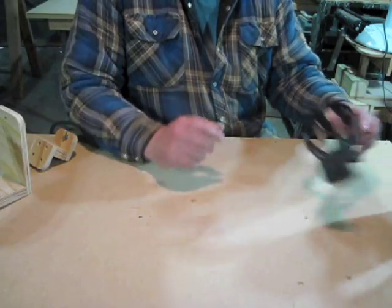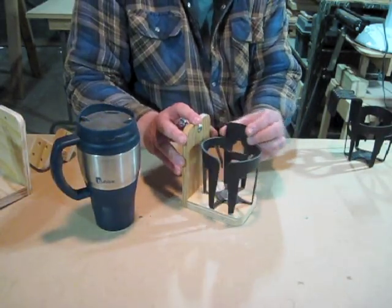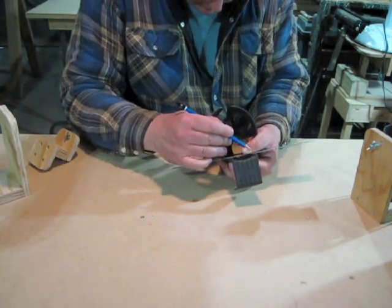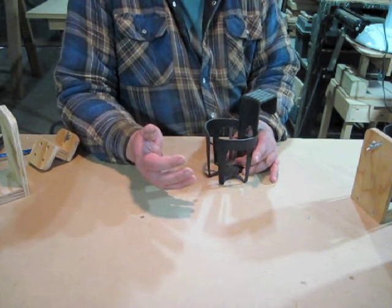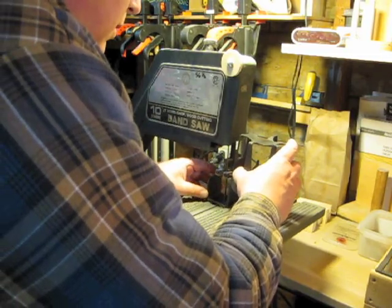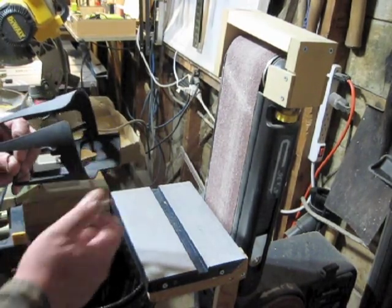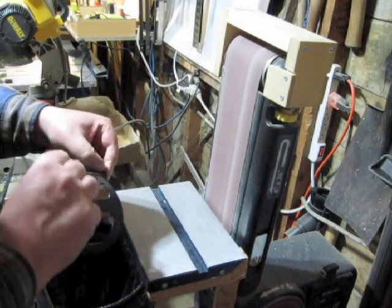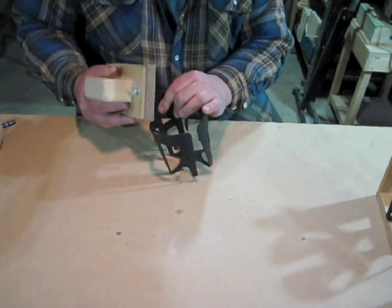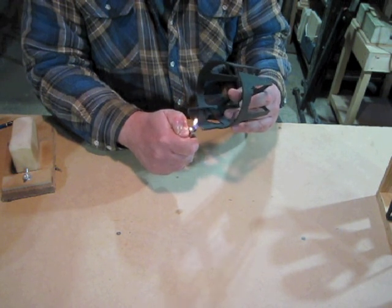There's the assembled pieces. Now the time has come to cut this hook off the cup holder. I like to leave about an inch on there — that gives a handy place to grip it so you can adjust where the slot is for the handle. This steel ruler is an inch wide so I'll use that to mark it. To cut this off you could use a knife, or scissors if heavy duty enough — I'm going to use the bandsaw. I left a little space so now I'll sand it to the line, finish with a little hand sanding to soften the corners. If you find little bits of plastic fur sticking up, take a lighter and carefully run it around the edge — that usually takes care of those pretty good.